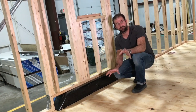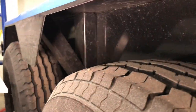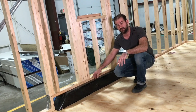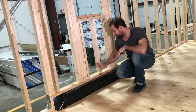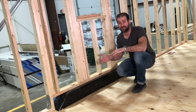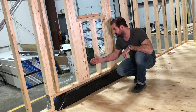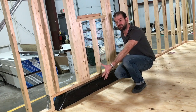One thing to point out is that we don't put headers above our fenders, because our fenders are structurally supported. If you're buying a tiny house trailer from somewhere like Colorado or other popular manufacturers that don't structurally reinforce their fenders, you'll definitely want to put a header there — otherwise your house will sag and have problems. But when using a trailer like ours, you don't need a header across that area, which gives a lot of flexibility: you can run mechanicals evenly throughout the house and place outlets down low.